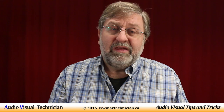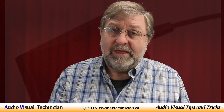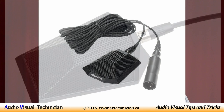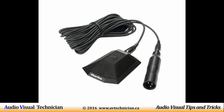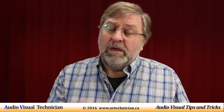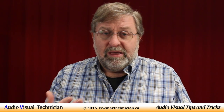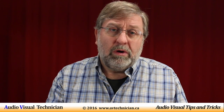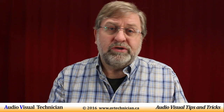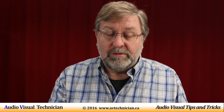One of the most classic examples of a microphone that typically gives trouble with phantom power is a PZM, or what some people call perimeter microphones. With perimeter microphones, it's about a 50-50 chance whether it's going to need phantom power or not. I've found it's best to just check carefully — turn the phantom power on and see if it works. If you need to run phantom power on everything and only have a single switch, be cautious in case you have any microphones that are sensitive to phantom power.